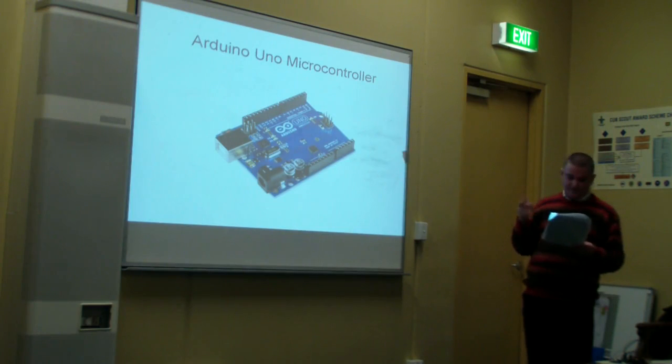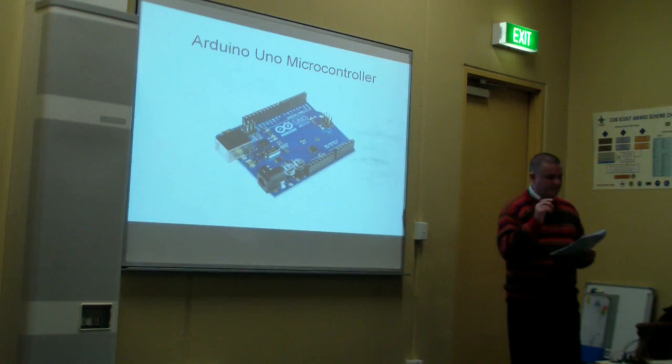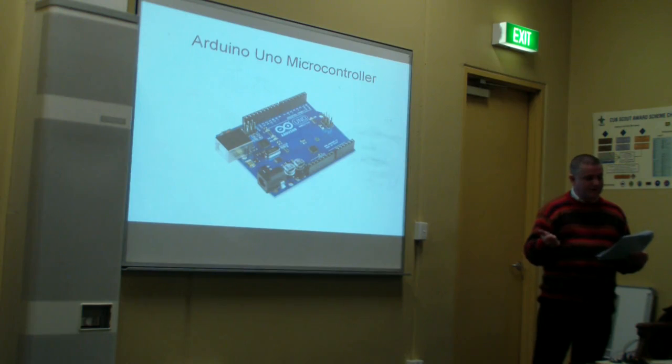So let's now go through the components you need to build a Picoballoon project. First is you need a Picoballoon or similar party balloon, some kind of microcontroller, which you might use as an Arduino, a small GPS, and a direct digital synthesizer chip, because that's what your transmitter is going to be based upon. You're also going to need a battery and or a solar panel, and some kind of simple antenna, e.g. a short piece of wire, and a bit of helium as well. So in addition to this, you'll need a party balloon, some helium, some twine and string, and something light to hold the components in, like a little phone case.